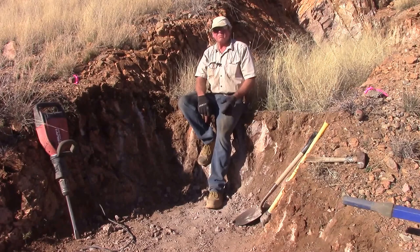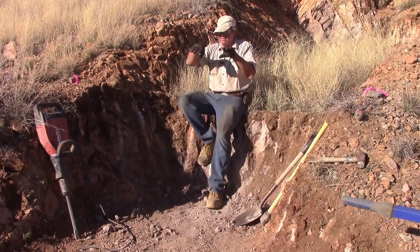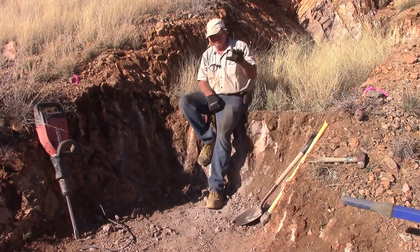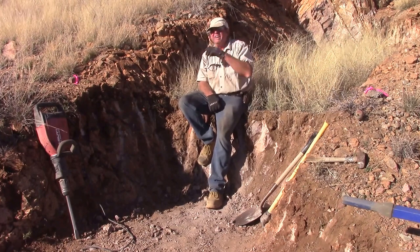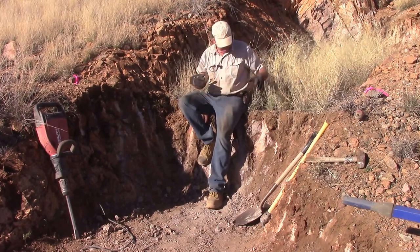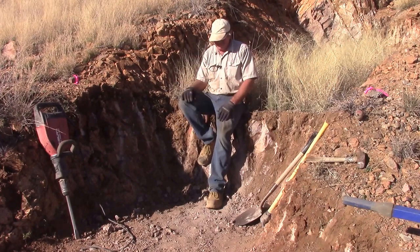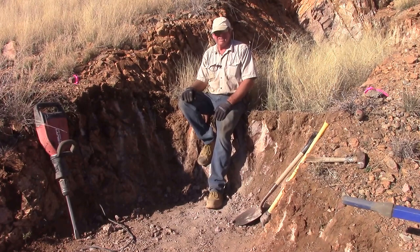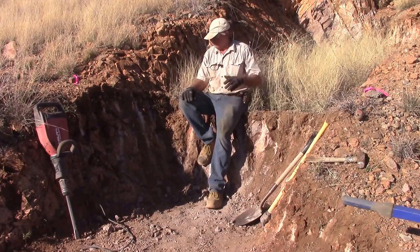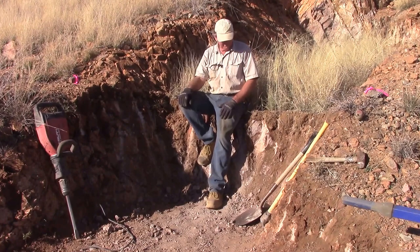And your big rocks go to the bottom. Your fine stuff stays on the top. Leaves a little pile about this high. You just flatten it out and keep going. Do it that way, you don't have to spend a whole lot of time fixing anything or smoothing it out. It goes pretty quick. Once you get dug down to grade or close to it, you're going to notice the toe is going to be up a little bit. Do what it takes to knock it down, dig that out, and then keep going. I'm going to take a single advance now using the time lapse, so to speak.